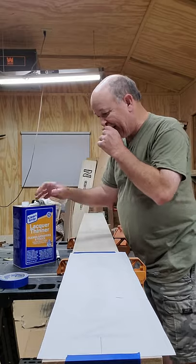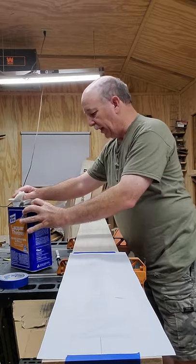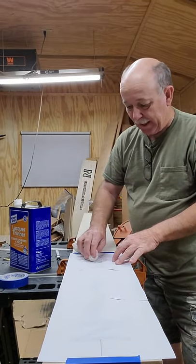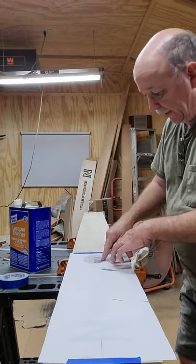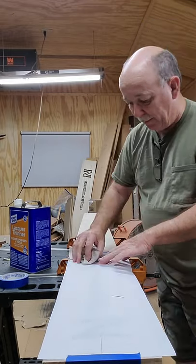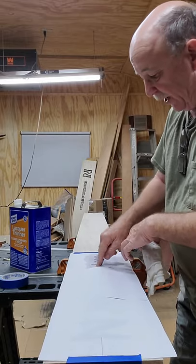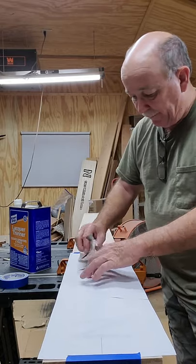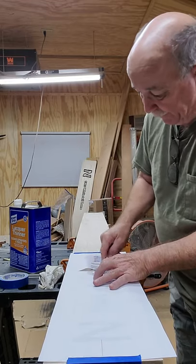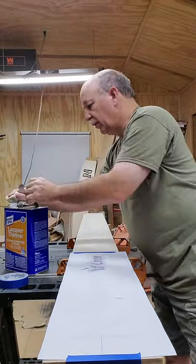The next thing to do is take a white cotton towel or a cotton rag — in this case it's an old t-shirt — and just put a little bit of lacquer thinner on it. I only do a section at a time, just a few pieces of the lettering at a time. Then I take the burnishing tool and just rub it down. That transfers the image right onto the board. Then I come back and do a few more letters, and just transfer it right down in this manner. This gives me a good, smooth transition — the ink transfers over real good, and you don't have to worry about it. It's all there for you to do your carving.